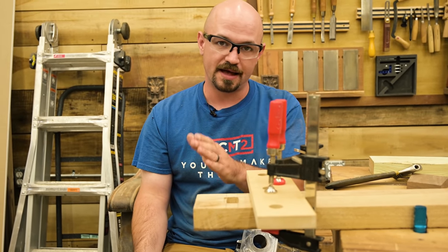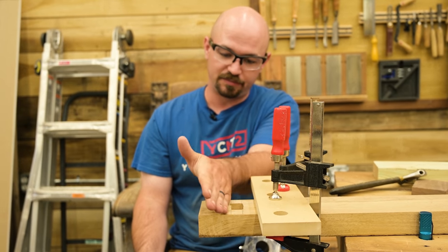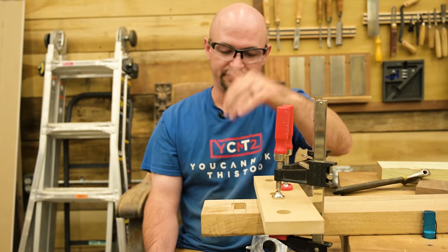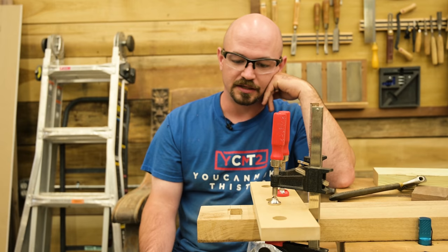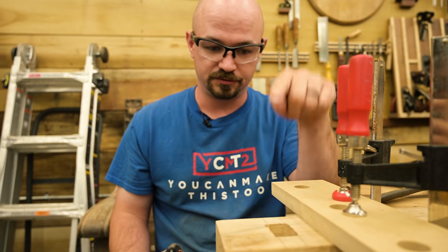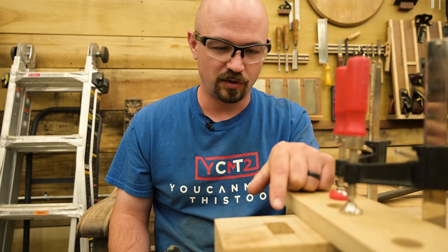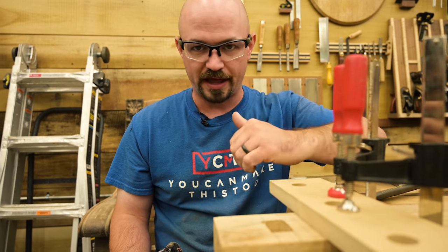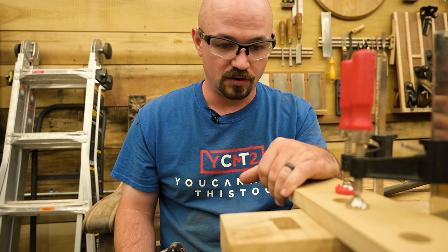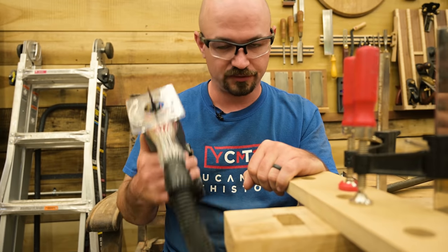The way I've done this before in the past is cut a wedge on the table saw or wherever, clamp it in place so then I have a slope surface, and then just use a chisel and use the ramp as a guide for the chisel. But I like mixing things up and making it hard on myself instead of just getting good at one technique. Another reason for doing it this way is one of the ways I did it last time was in soft maple, I wanna say, but trying to chisel that end grain was a nightmare because it's super hard, and this oak is also ridiculously hard, I've learned. So trying to chisel that end grain is gonna be a nightmare. Another reason for the router.